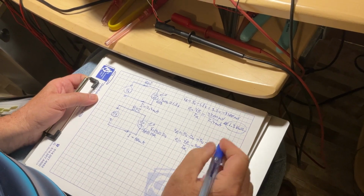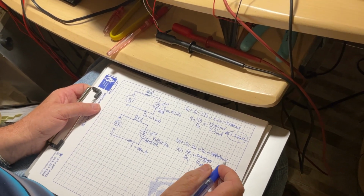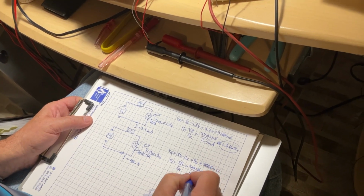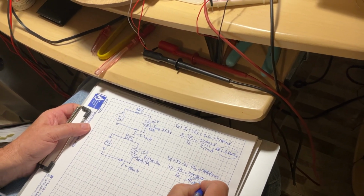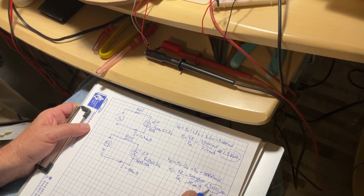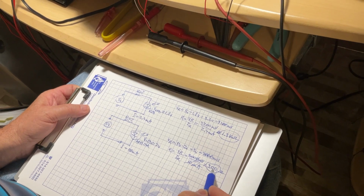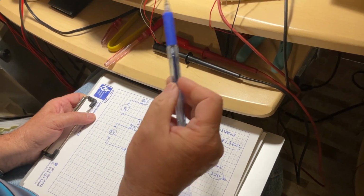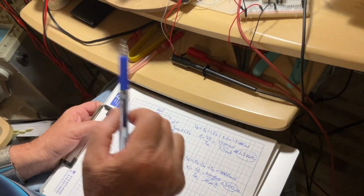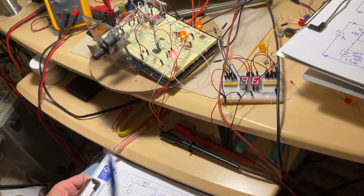Milli and milli, they go out. Volts over amps, it's giving me exactly the resistor in ohms. This time I don't need a pocket calculator. The 10 here cuts 1 0 from the top. So you need something around 300 ohms. Hey, take a look. There is a big difference between this and that. So this is where it's important to understand when you match the brightness for different LEDs, maybe not all of them, they need the same resistor. That was exactly the point of these diagrams.